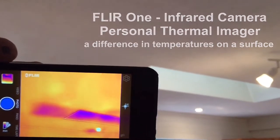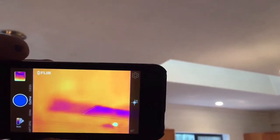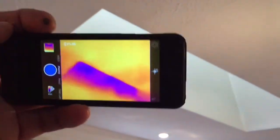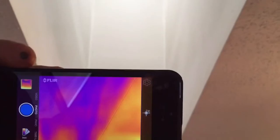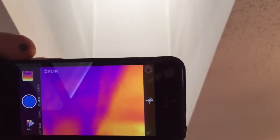You'll notice that the skylight right beside it, there's a purple section. Where that purple is, that means there's no insulation above that section of drywall, which is actually the ceiling. If you come closer, we'll look up inside the actual skylight chase itself — you'll notice it's all purple. What that means is it's not insulated at all inside the attic space.